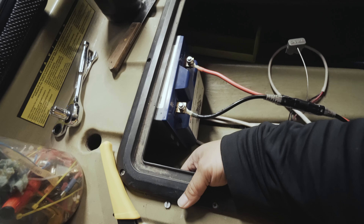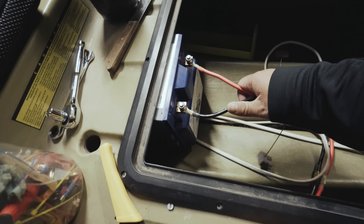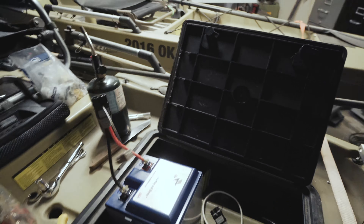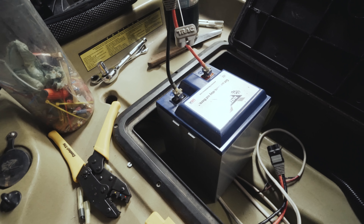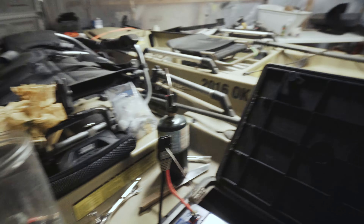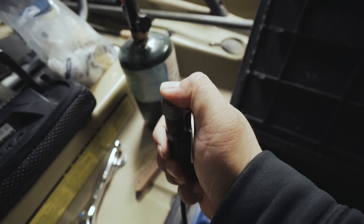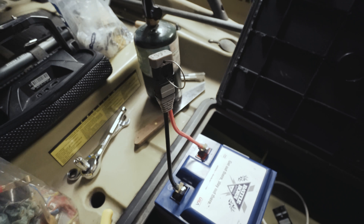The only reason why I want to do this is because I do take the batteries inside to charge, and if I'm traveling I don't want to leave it in the kayak because it's a fairly expensive battery — somebody can just come by and take it. So what I'm going to do is reach in here, pop the fuse — not that you have to, but you can — pull that down, pull this out, leave the batteries indoors and go charge it. We're going to charge it with a new charger. I emailed the people and they said you've got to have a lithium-specific charger. Here's another cool thing: you've got a protector on it so you don't short that out and cause this battery to melt down. That's a big plus.